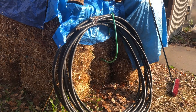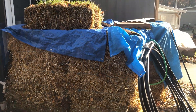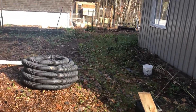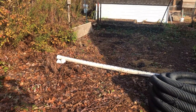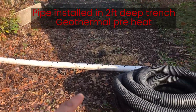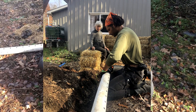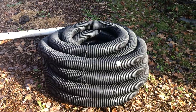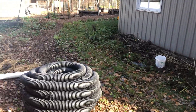The whole corral will be made out of straw bales and we're going to build here on the west side of the building. You can see a perforated pipe with an elbow — that's going to bring in fresh air that passes through drain tile, which will be coiled at the bottom of the pile in a roughly 10-foot circle, laid flat on the ground. Then we'll surround it with straw bales.